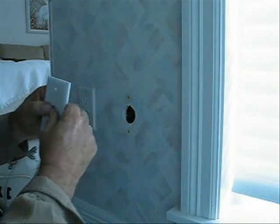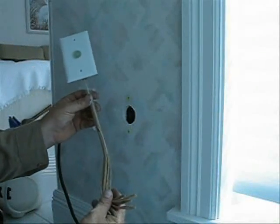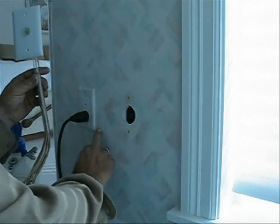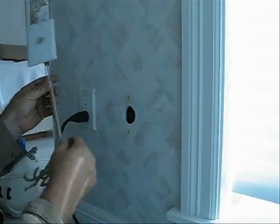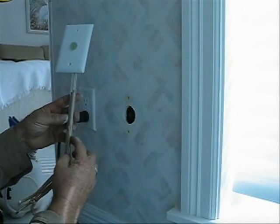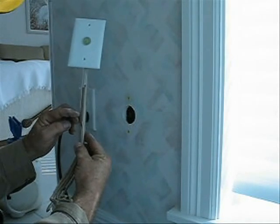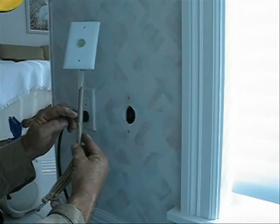I'm going to go ahead and install it here. I got my hole, I manipulated it — there's a little insulation right there. In this particular area where he's got these mounted, I've trimmed the cellulose on the bottom a little bit. You can also bend this device in this area, but you just don't want to bend it above the midway point of the second layer of cellulose.